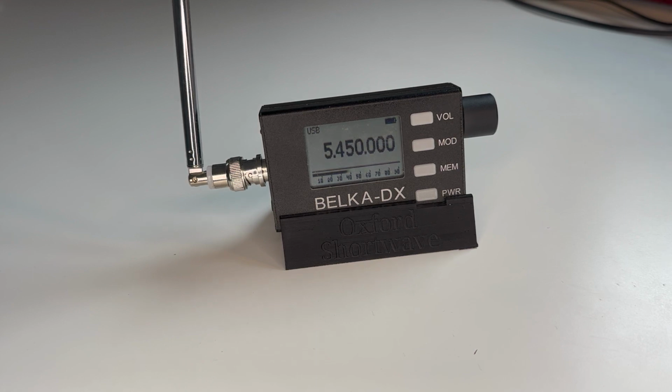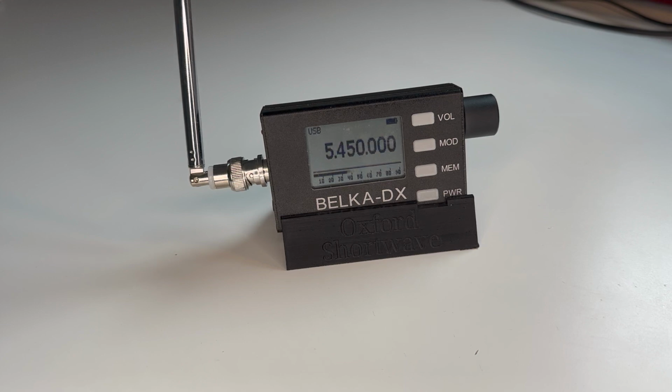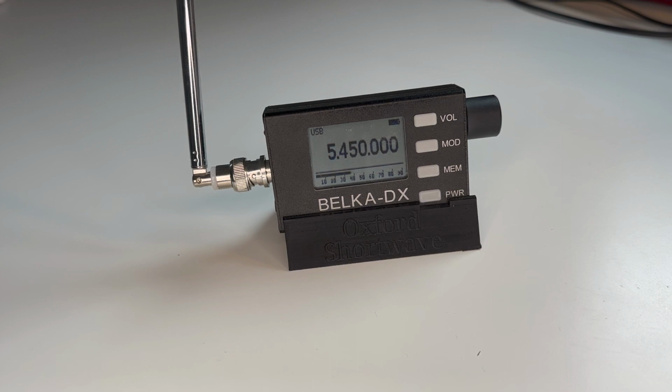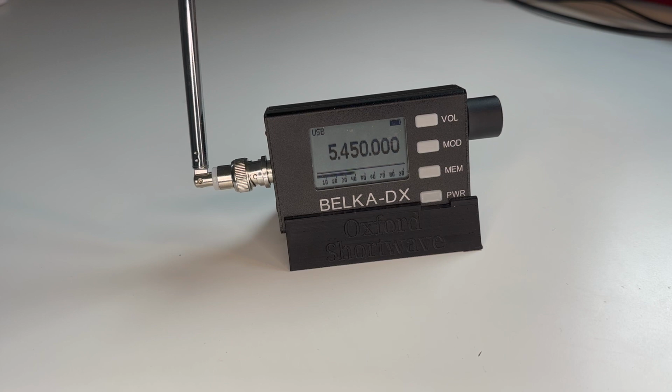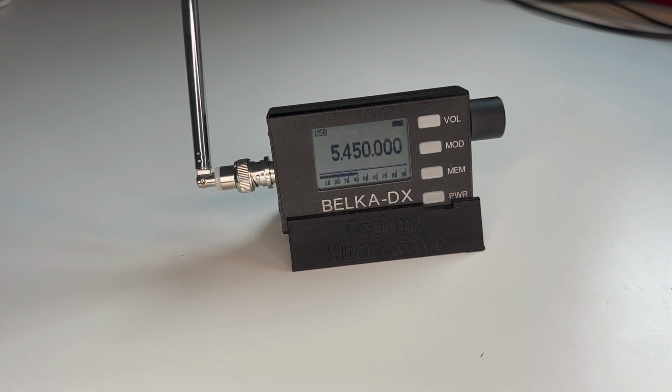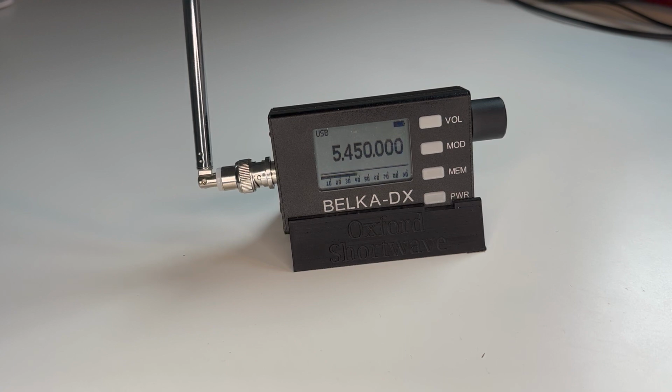not as small as this, mind you, but you know, the ICF-SW07, the SW100, the original SW1. It's a fantastic receiver, and it's not that it should have made the grade or could have made the grade. It basically didn't, because of two factors really. One is that the original version started at 1.5 megahertz, so basically you missed most of the medium wave band, all of long wave, etc., but you got all the shortwave up to 30 megahertz.